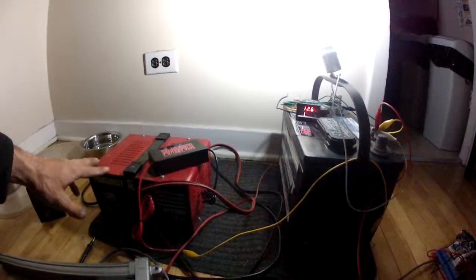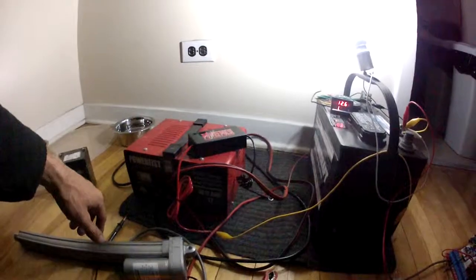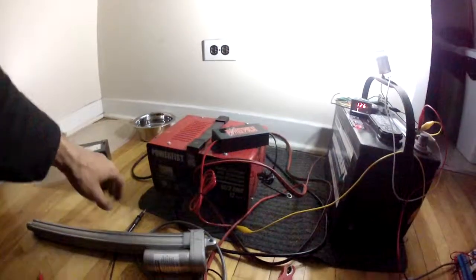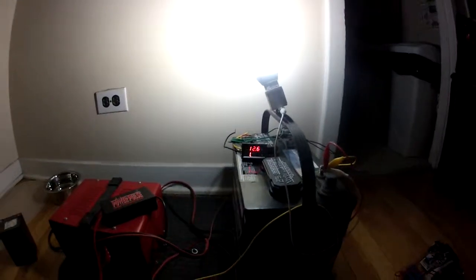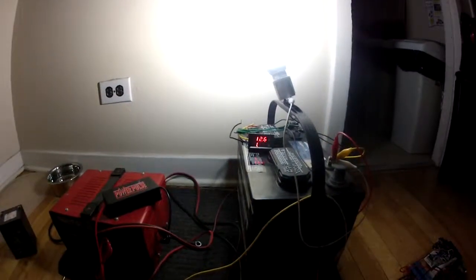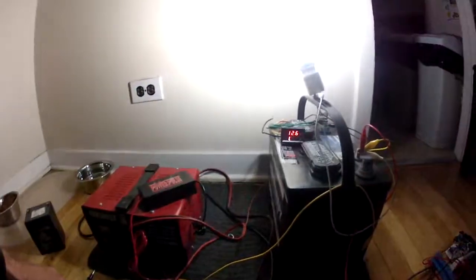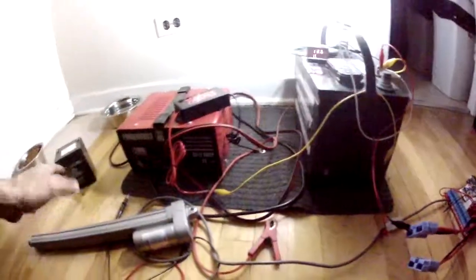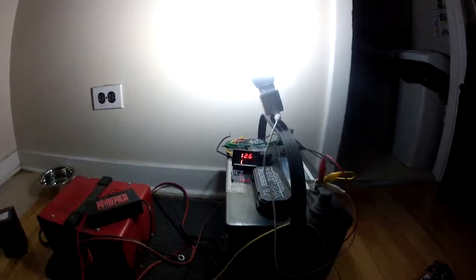To my surprise it does seem like it works, even overnight. It was reading about 12.8 volts but didn't seem to want to go any higher. I kicked the charger from 2 amps to 10 amps, and a little bit later we had jumped up to 13.2 volts and the charger thought it was done. So I hooked up the 12-volt 3-watt light, and it rose all the way to 14.2. I've had this light running for 2 days now, along with the actuator, and we're still sitting at 12.6. I think I got a little bit of a success.